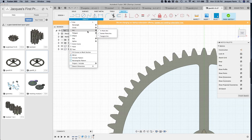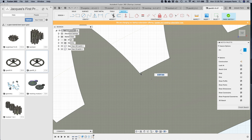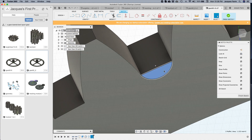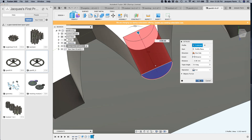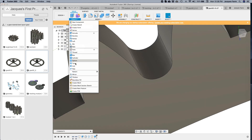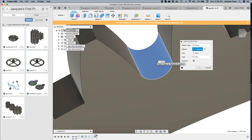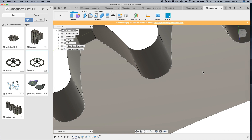I'm going to select the arc tool and place an arc at the root of the teeth. Place the arc, click OK. Now I'm going to extrude — click OK. Then choose circular pattern, and now I'll have 60 radiuses for all teeth.